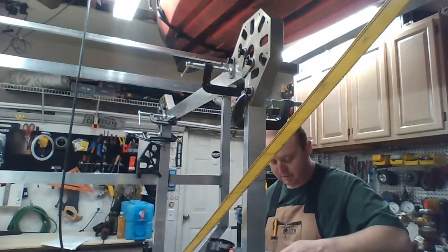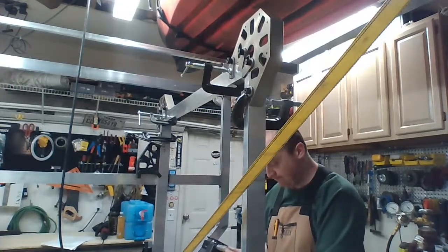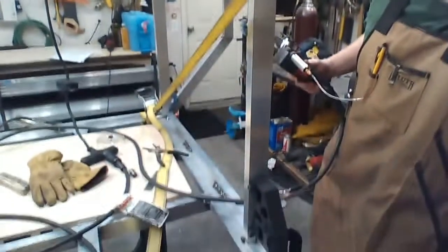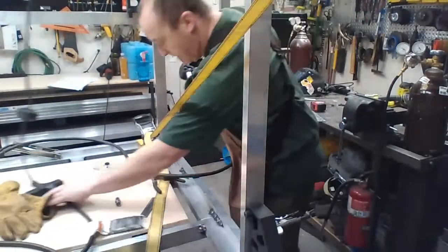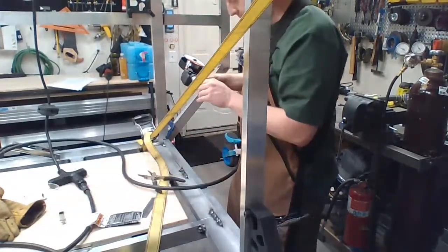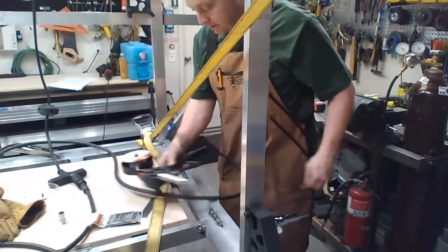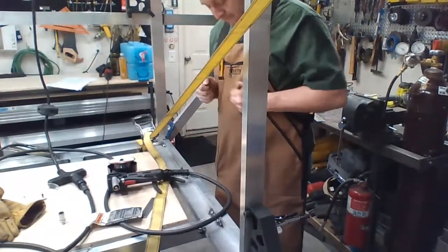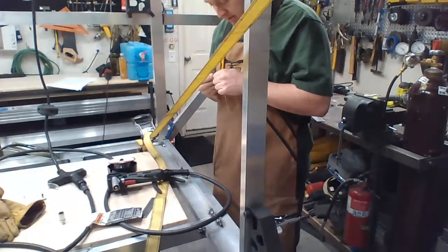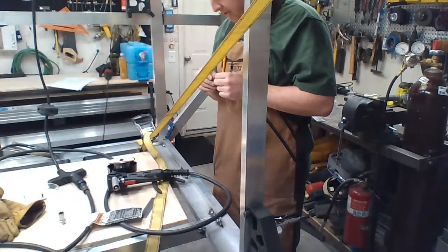Get bunched up. So I'm gonna figure out how to get that out. Take the tip off. Get it lower angle so you guys can see. So first off, I put this bar. Don't need that part right now. Don't need that part. I'm gonna put a piece of plastic in there. That's not good. My tip might have been foobarred. Here we go. So I think aluminum globbed onto the tip. It caused extra resistance and a nice cascading foobar.